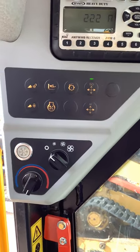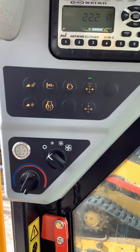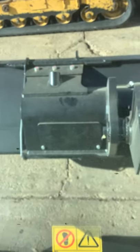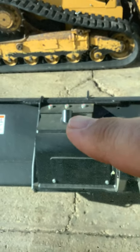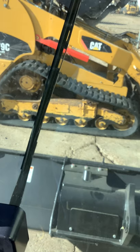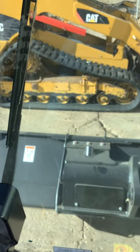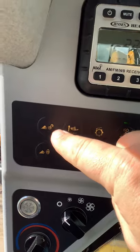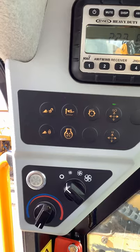Starting over here on these buttons on the top left of your machine, this unlock and lock button is going to be for your hydraulic quick detach on the tool carrier. In that cylinder right there, there's a red plunger. When you have the bucket tipped back towards you, you can see it better. When that plunger comes all the way up, that's when your bucket will be disconnected from the pins on the tool carrier so you can detach from it. You're going to push and hold this unlock button and that plunger will pop up and then you can disconnect the bucket without getting out of the cab.